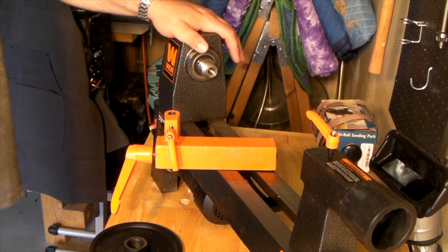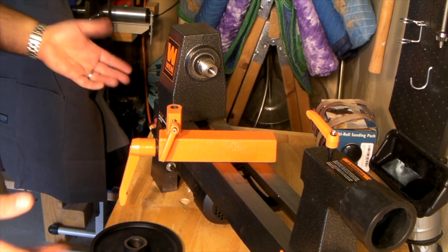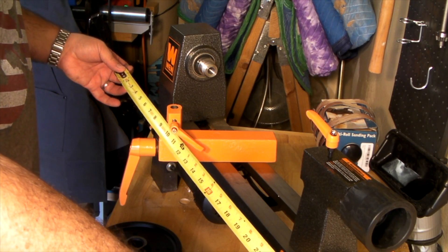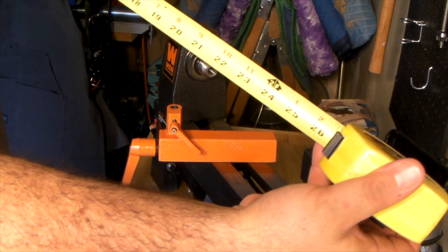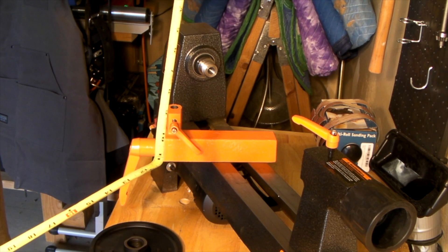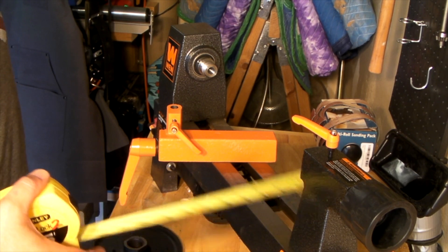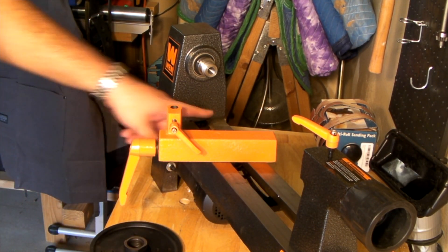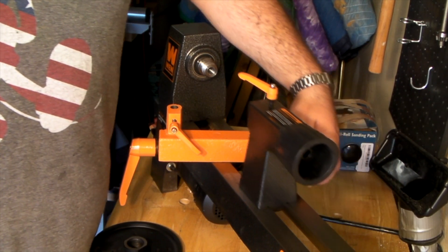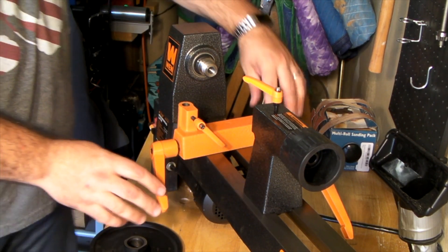Here's the lathe spread out a little bit. The headstock is solid cast iron, as is the rest of the body — it's a solid piece so you're just dealing with a straight throw. The main distance across is a little more than two feet wide and it's under about a foot tall, around 11 inches. It's got a pretty decent footprint, very easy to fit on a benchtop. We have that 8 inch working area across the face, and the movable tailstock allows up to a 12 inch piece of wood. The tailstock glides very nicely, as does the banjo.